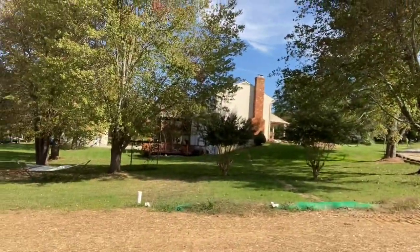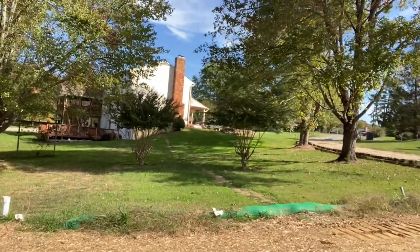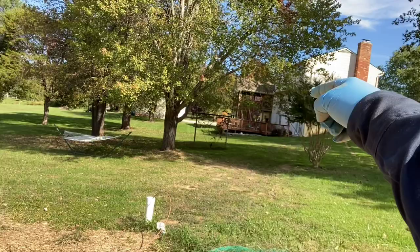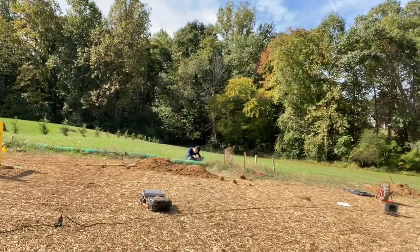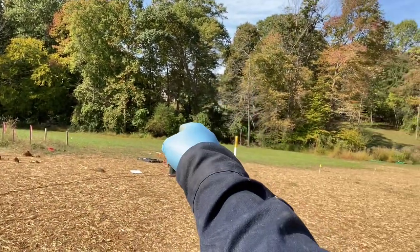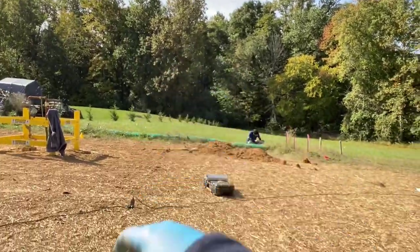Starting with the house — it's located over there, just showing you for reference. The house is there, the septic tank is next to it — we didn't inspect it. There's a line coming from the tank up to a clean-out, then to a splitter box and a D-box. That splitter box sends another line to another D-box over there, and from there we have the drain field line.